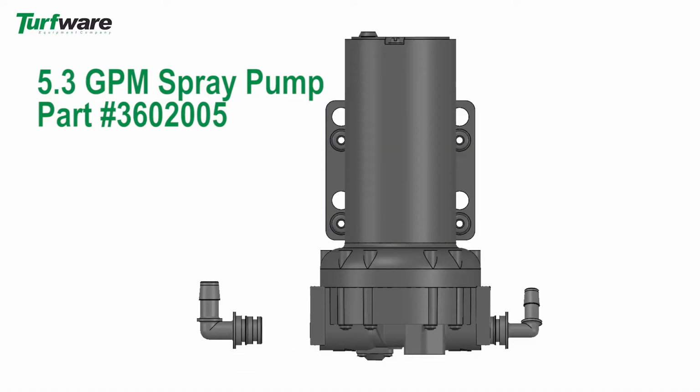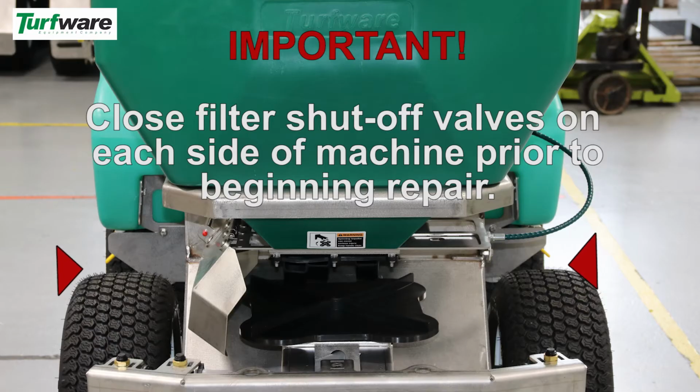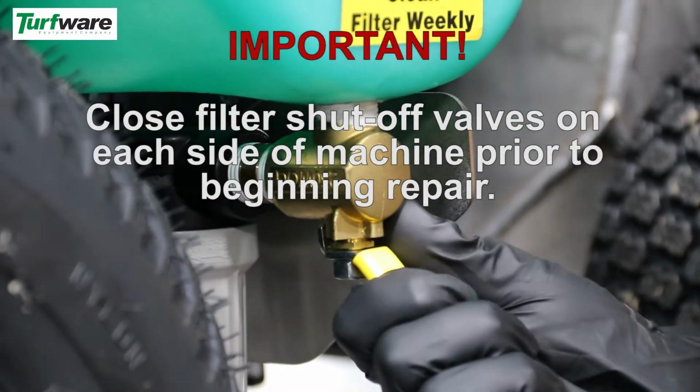The 5.3 GPM pump is part number 3602005. You will need a 7/16 socket and driver and a 7/16 wrench. Close filter shutoff valves on both sides of the TR460 before starting this repair.